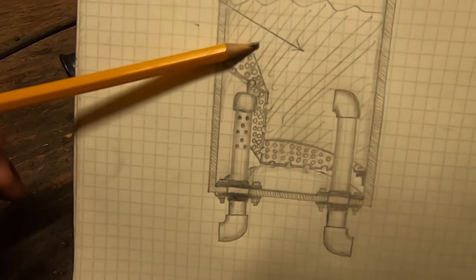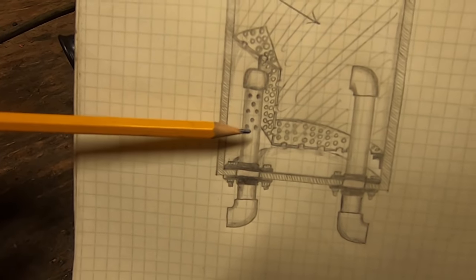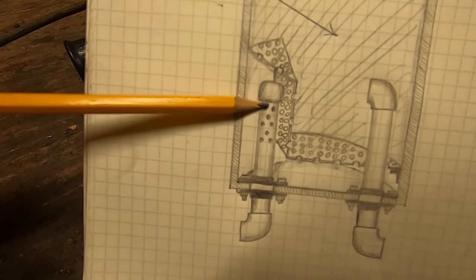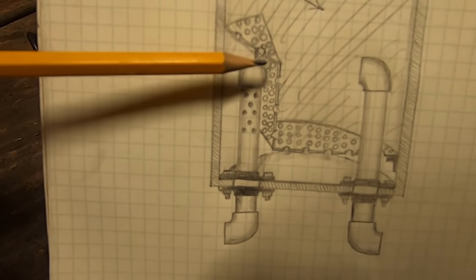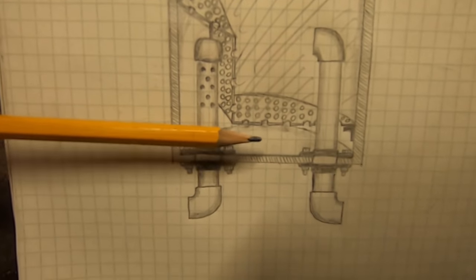And this will be, again, surrounded by a grate, which will act like the burn shaker grate in the downdraft gasifier design. And then the draw, because we don't want crap falling down to the top of this, we want a grated system as well here, just to keep ash from going up our pipeline. And I'm just going to do that by drilling some holes in the pipe and then capping off the end. And we want to make sure to end those holes further up than from where the ash might accumulate.